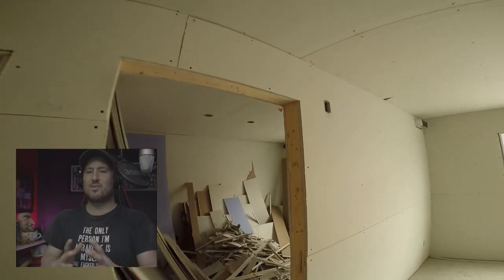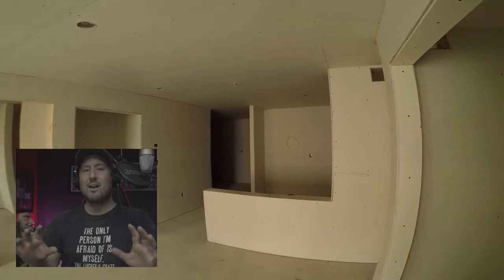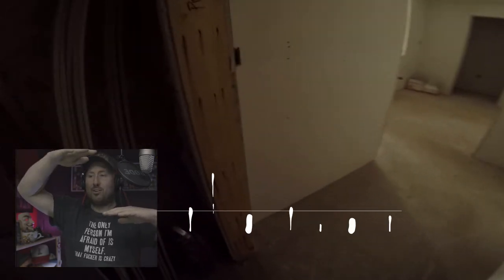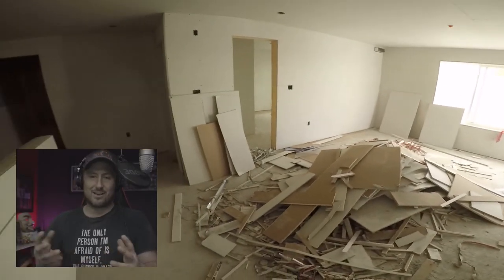I do a thorough job cleaning — I clean before, during, and after. My units are mint, beautiful. There's another broken corner, but that one was the electricians' fault. The boxes are way too low — we have to pre-cut every box on the first layer in the ceiling. We should be able to put the board up and router it out quickly, but now we have to pre-cut all the first layer. All the trades on this job are being rushed. In the end the drywallers are dealing with all the problems.